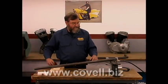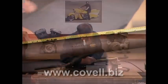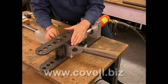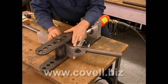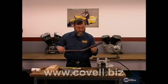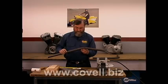The first step is to make a layout mark ten inches from the end of the tube, and I'll show you how this is set up in the machine. So there's our bend — it's a very nicely formed bend, very uniform, very smooth. There's almost no ovalizing of the tubing at all. It's come out very nicely.